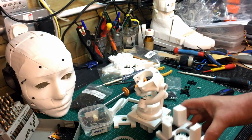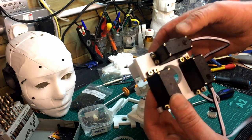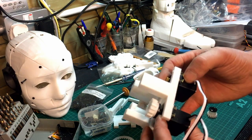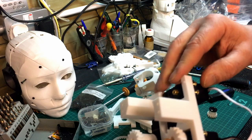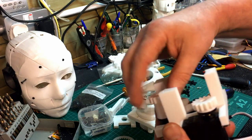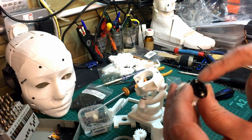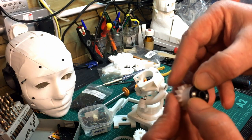I've mounted the three servos on the base plate. I'll just ease these holes out by a couple of mil to just sink the self-taps into — I took them out by about two to three mil, just so these would sit in without shattering the plastic. I've just used the bases of the servos, which I think is what you're meant to do. I've made these holes in the black bit up to about three and a half mil so I can get these small screws in straight.